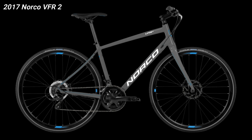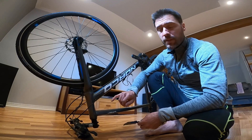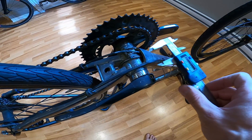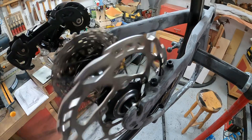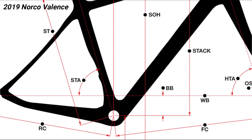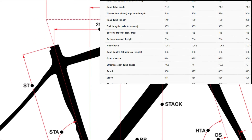When I decided to start this project, the idea was to make a carbon frame to replace the aluminium frame of my hybrid Norco VFR, which I used to go to work every day for the last 3 years. So I took off the fork and began to measure the headset outside and inside diameters. I took a lot of other measurements such as the bottom bracket length and its diameter, the gaps between the dropouts and the rear wheel, axle length, front derailleur position, and so on. Copying an existing frame allowed me to know the exact position of some critical parts like the disc brake brackets. I also used Norco's drawings on the internet to put my project on paper and to get some information which was difficult to get directly from my aluminium frame.